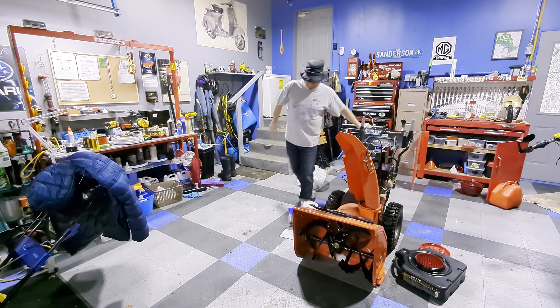Using a 13/16 spark plug remover and she's out. Have a look at her — she's pretty carved up, so it's time for a new one. The gap is 0.027 to 0.030. We're going to stick the new one in and check that this fits.